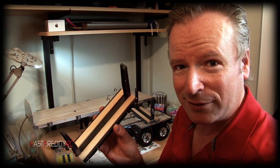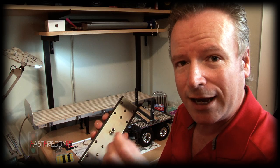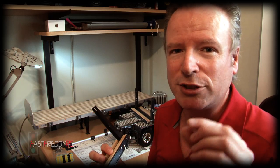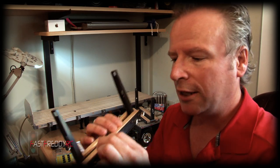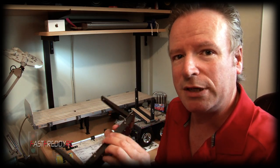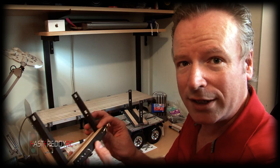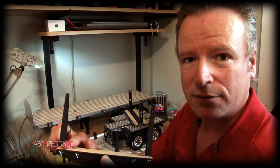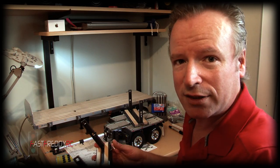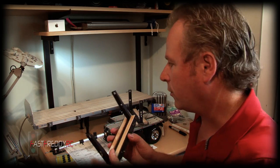Be very careful that you've made sure that the screws that you put in are the right size. I made the error of one of them was too long, so I put on the double-sided tape. It's a minor difference, but it was enough that when they were screwed tight, the wood wouldn't go down, and I had to go through and figure out which are the screws that were wrong. So just be careful when you're putting these two brackets together that you've got the right screw before you put down the wood and the double-sided tape. I managed to fix it early enough that it wasn't going to cause a problem, but I hadn't noticed it. So that's one step that I would be careful on.